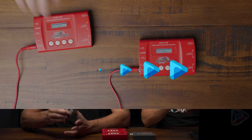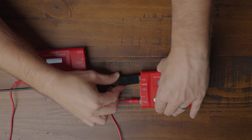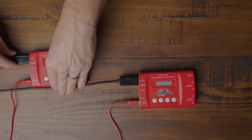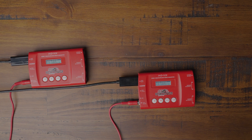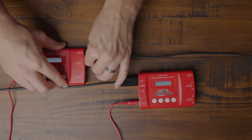With that idea in mind, we need to apply the same concept for our key and fill HDMI to SDI converters to make sure the frames for each stay in sync as they're sent to the video mixer for overlay. Knowing that, we need two converters for the key and fill. There's a way to sync the frames using the Decimators or the Blackmagic converters. With the Decimators, you can use one of the converters as the sync generator and the other will act as its slave. The setup will include plugging in both HDMI cables from the computer's video card into the HDMI input — one on each Decimator — and plugging your two SDI cables going to the mixer into one of the SDI outs on each Decimator.